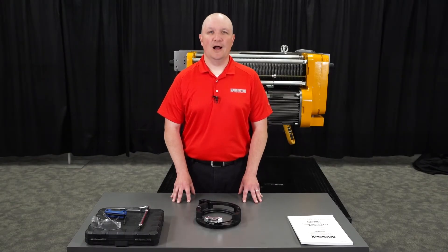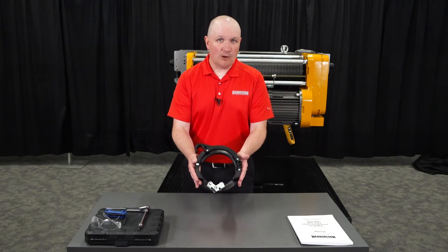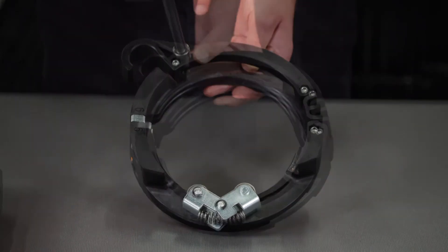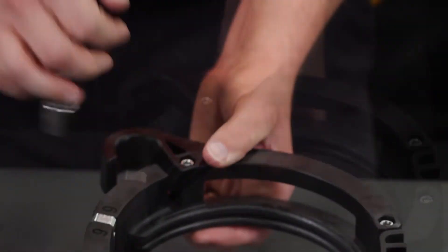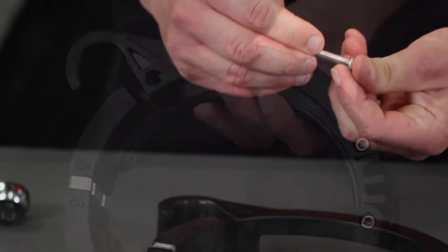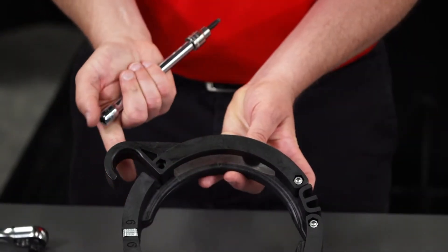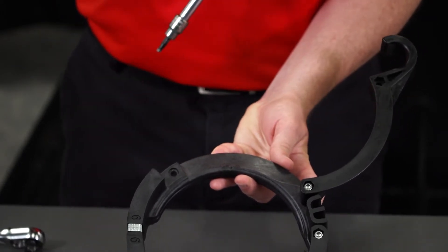When you receive your new replacement Rope Guide, it will be identical to the one that came on your hoist. Your Rope Guide will be completely assembled and will require some prep in order to install it on the hoist. What I always like to do is remove the bolt located directly under the hook — this is what allows the Rope Guide to be installed without unreeving the hoist. Remember, the nuts are captive nuts, so just make sure your hand is behind them as you remove them. We will also loosen the socket head bolt at the end of this segment of the Rope Guide, which will allow this segment to open up as your hinge point. Now the rope can pass through there and allow you to install it while the wire rope is still on the drum.